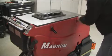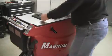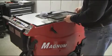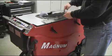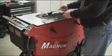Next, check the recovery tank lid latches for damage, as shown here. Once this is completed, check the recovery tank sight dome for damage and make sure that the lid is cleaned properly. Make sure that the sight dome seals, the lid bead, along with the lid flange are in good working condition, as demonstrated here.